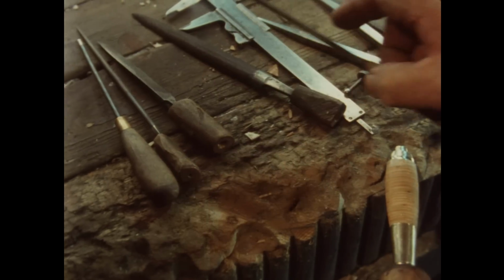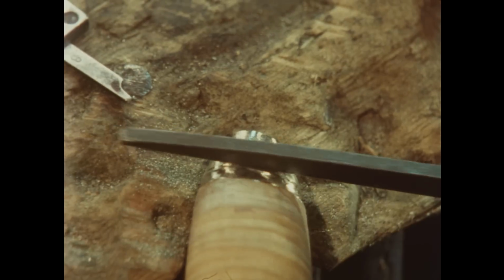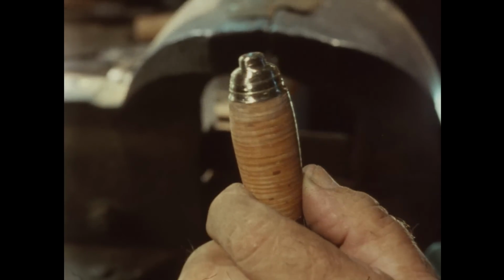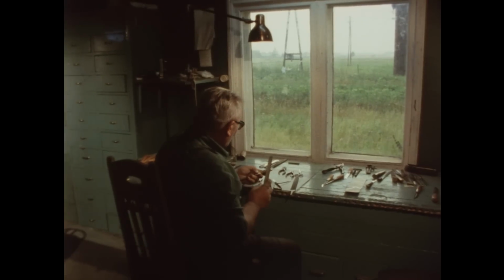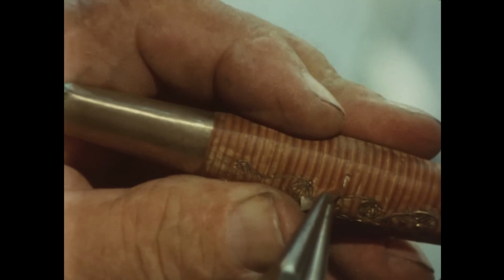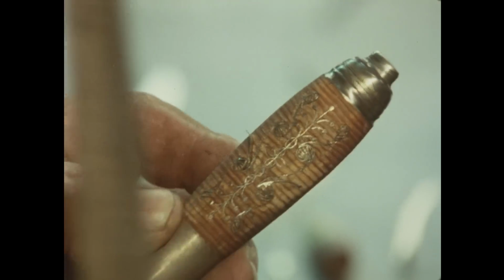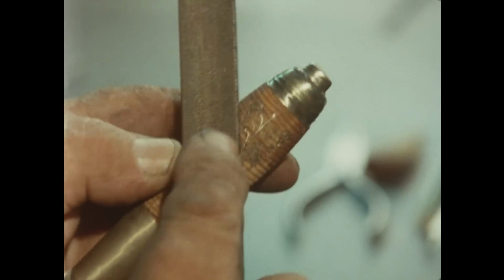Knife handles are made of other materials too. The work knife handle is usually made of wood. Birch bark is much used for knife handles because it is light and pleasant. For as long as birch bark handles have been made, their heads have been furnished with metal decorations. The decorations must be inlaid about 4 millimeters deep so that they don't come apart. The material used in decorations is either German silver or brass, from which 4 or 5 millimeter broad strips are cut.